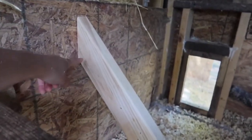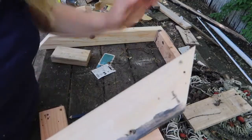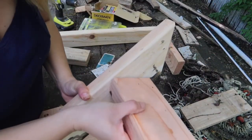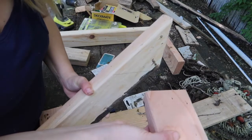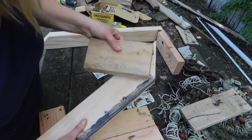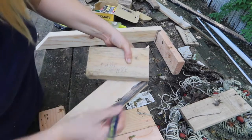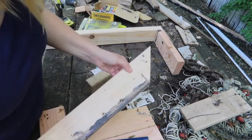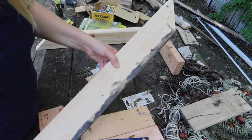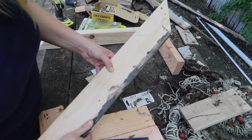The first little step will probably start right at the bottom of this. This is going to be the top that goes on the wall, and I want these steps to sit flat, parallel to the ground. I'm using a piece of wood as a 90-degree angle, lining it up and drawing a line right here - that's where I'm going to line this up. I'll space out how many steps I want and draw parallel lines on both sides.